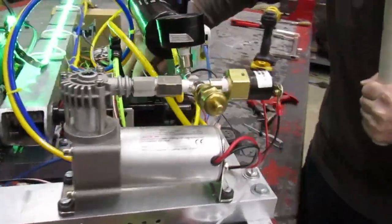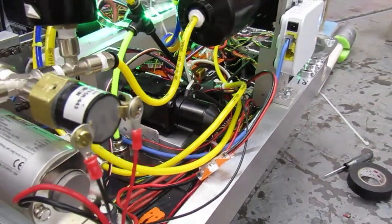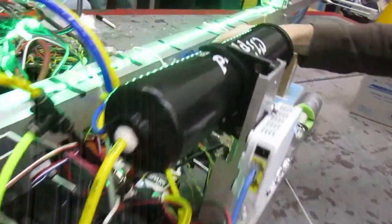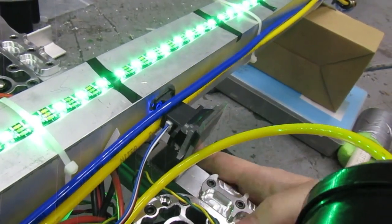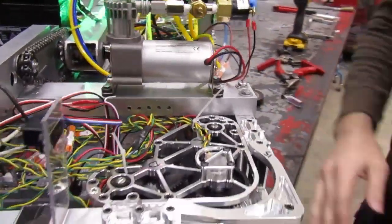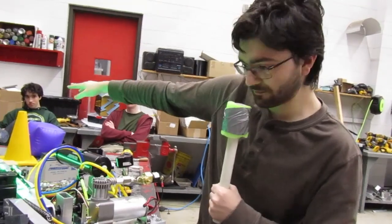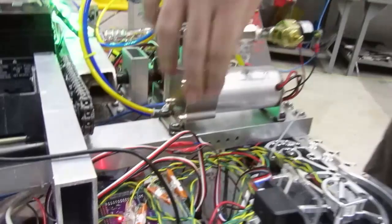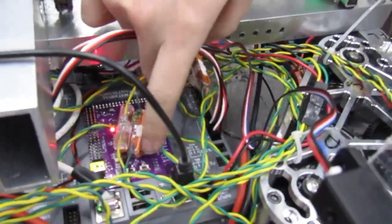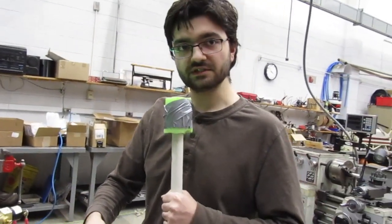The Neo motors also have encoders built in for more control over everything. Over here we have our magnetic limit switches to ensure that we do not damage our frame when moving our arm — very important. We also have the classics: a compressor and tank for the whole pneumatic setup at the front, and right here the NavX — the heart of our drive — sporting a gyroscope and accelerometer, which allows us to know where the robot is in space.